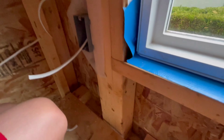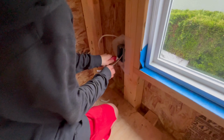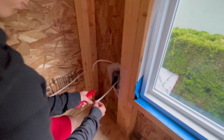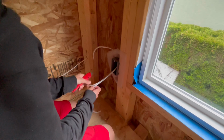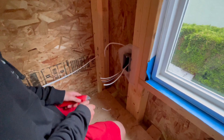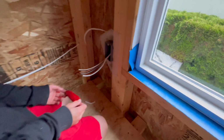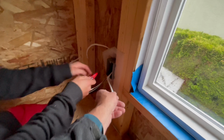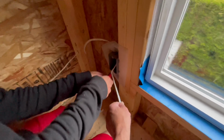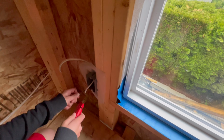So now take this and cut this down here all the way through. Don't cut yourself with your fingers. There you go. Nice. Nice work. Okay. And separate it. Inside is a white and a black wire. You know, one is hot, one's neutral. What do you think? White's hot. I mean, black is hot, white's neutral. Okay, so cut off the extra insulation. Just give it a little snip there. And try and go away from you. Yeah, up and away, that's great. Pull harder. There you go, okay, good.